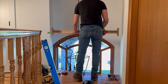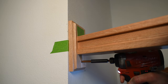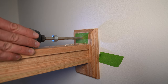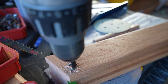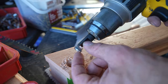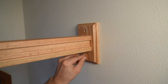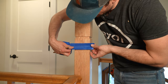These rosettes make the installation process even easier because I can pre-drill holes within the rosettes and drive screws directly through them into the framing. With the railing level and fully secured, you may wonder why we're drilling straight through the rosettes, leaving an unsightly hole. That's where our plug system comes in. You can purchase pre-manufactured plugs but they don't match the finish exactly, so I'm making my own plugs. This simple device creates a plug that perfectly fits the three-eighths inch hole using a scrap piece of the railing so it matches very nicely. Once the sides are slightly sanded, I install the plugs, match up the grain as best as possible, and give them a few love taps to encapsulate those fasteners.